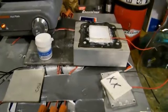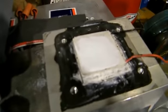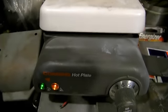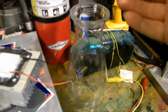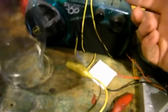So I immediately bought a dozen of these things and some giant heat sinks, and I had myself a little hot plate here to simulate the wood stove. And I found that if I take one of these little modules, I think it's a 55 watt, put it on top of my little hot plate, anywhere from 200 to 250 degrees, use this little aluminum heat sink, a smaller piece of aluminum for height difference, and you simply put the globe from a kerosene lantern on top to do the chimney effect, you can generate enough voltage and current to actually run one of these little portable wind-up radios that run for almost nothing through the sun or to wind them up.